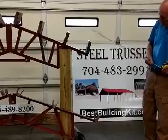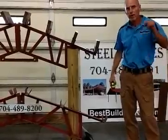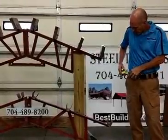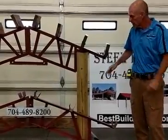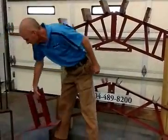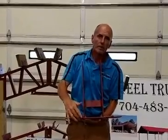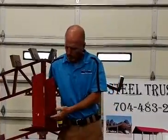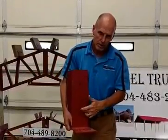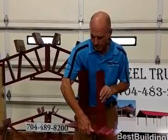Now, the most typical way with a post frame building or a pole barn is you dig a hole in the ground and put the post in there. The farmer's rule of thumb is for every 3 feet you have up, you have 1 foot in the ground. We have some other options for attaching the poles, because if you're going onto an existing concrete slab, you can use this. We call this a dry set anchor. Very heavy duty. As far as I know, it's the most heavy duty one in the industry. You've got a stabilizer bar, which I've not seen on any other competitors' models. You've got 2 holes here, and you've got small holes for temporary nailing till you drill your holes. And you would through bolt it, and you would molly or redhead this into an existing slab.